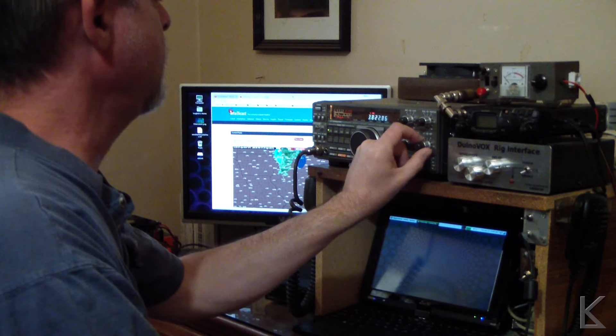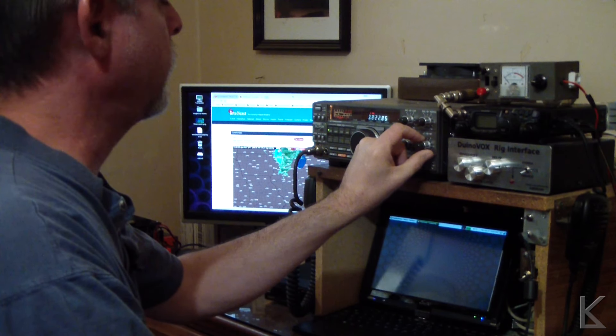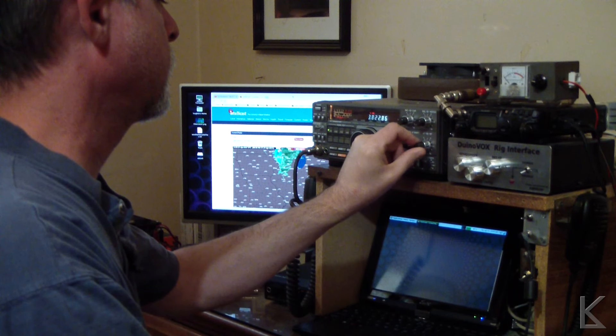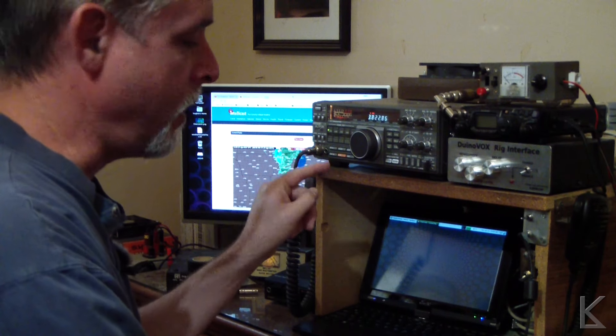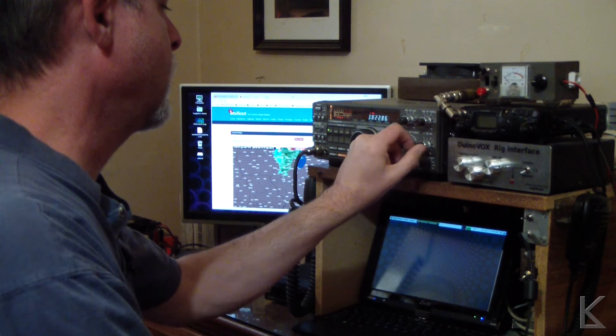It's not in the receiver, although the AGC tail seems to accent it. It changes with gain, and I don't see it on the audio output on the accessory jack on the back of the radio. So it's either right in the AF section, or it could be the AGC section picking it up.